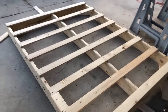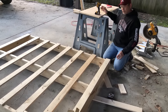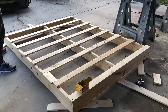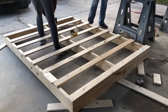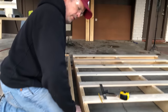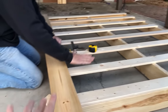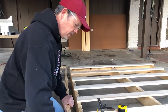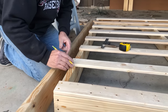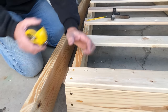All of the slats are down with our spacer block, but we only have two screws in each one, so we've got to secure them for real now. Now that we know the spacing is good and everything looks good, we're just going to go around and sink the rest of the screws. We've got this part of the bed complete — the slats are all attached. Now it's time to attach the two-by-six that will make the lip.